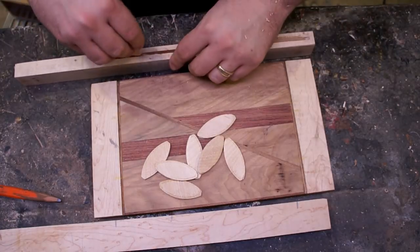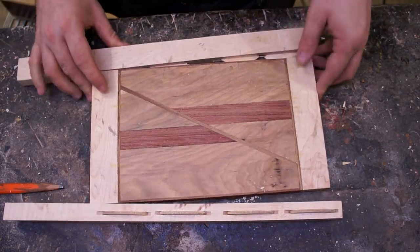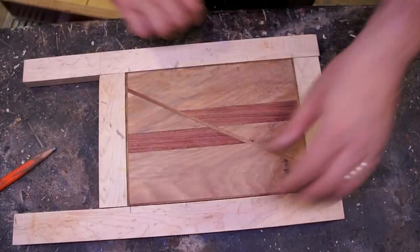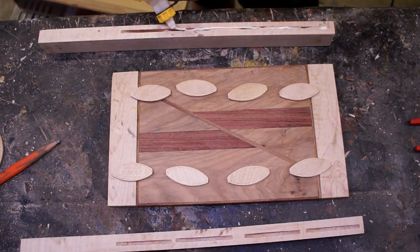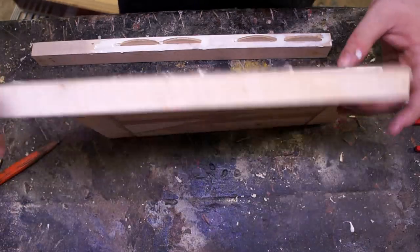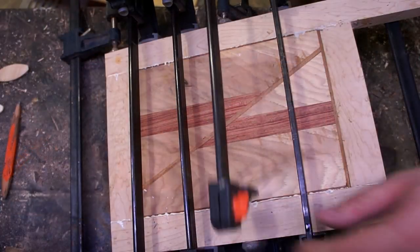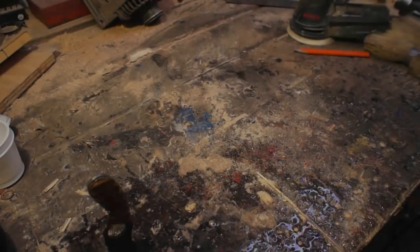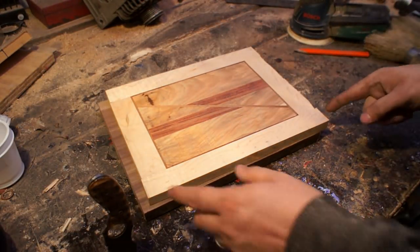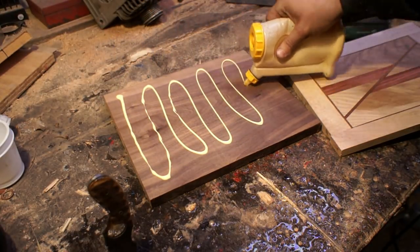So we're finally getting to the final glue-up and the final biscuit joining. Every time I use the biscuit joiner I always make sure to preassemble — it can be a little tedious, but you do find a lot of errors in your work, like sawdust stuck in one of the holes. If you throw glue on and just try to put it together the first time, inevitably something won't line up. I left those boards long on the end because I still thought I might be able to run it through a friend's planer, and I figured those runners might help with snipe on the end.